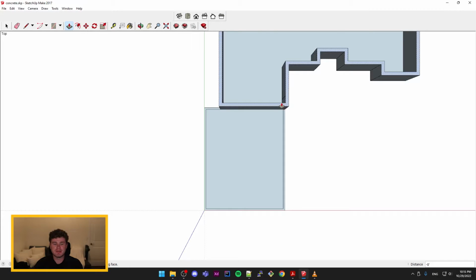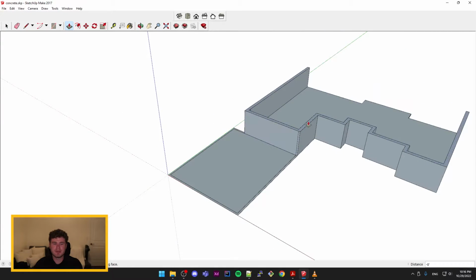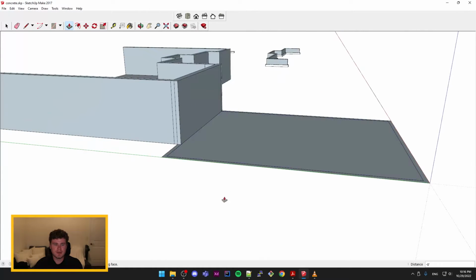The garage is going to tie into the basement ICF, so that's why it's going to happen last, because our excavation guy is going to come back and do some backfill where the garage is going to be, bring in some dirt and some rocks and compact it really nice. That way it doesn't sink through. And then we're also going to have rebar running from the ICF wall into the stem wall or foundation for the garage.